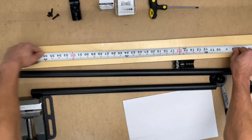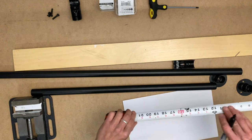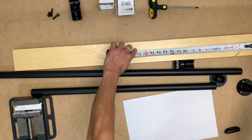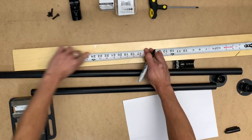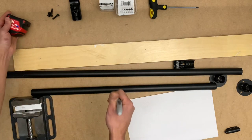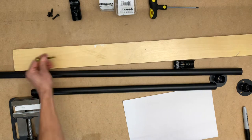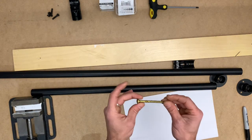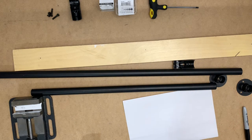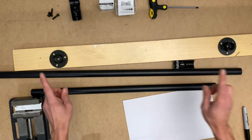I'm going to measure from the center — 20 inches — and from that point measure 16 inches to both sides, because my floor joists are 16 inches apart. That means I'll be able to fix this piece of plywood to my floor joist. At 16 apart, that's 32 inches total, and we're going to use lag bolts to fix it to the floor joist. It's really strong and it's not going anywhere.